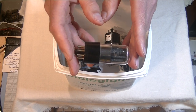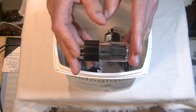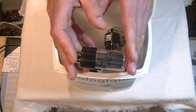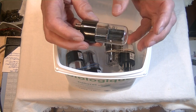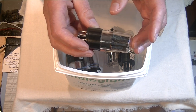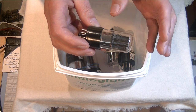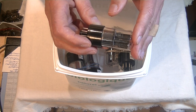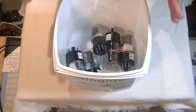And the big problem with any tube, but in particular 70-plus-year-old tubes, is that they might test electrically beautifully. They might even look new, but they need to be plugged into either test equipment so that you can look for noise, or in my case, I try to keep as many amps available as possible. And these just came in today. They're already tested. They're already in the inventory, actually, in the store. But I'm going to sit down with these tomorrow, and I'm going to make sure that they sound good, that they don't have any noise issues. And when I ship a tube out, if I have an amp that handles that tube, I sit down for a couple of minutes to make sure that the tube is good, that we don't have any problems. And that eliminates a lot of trouble later on.